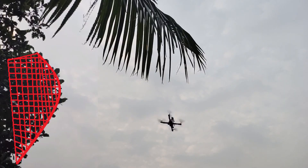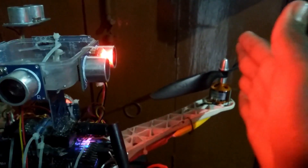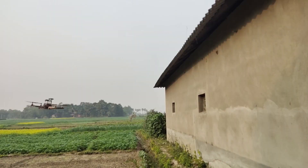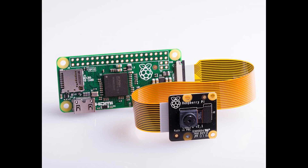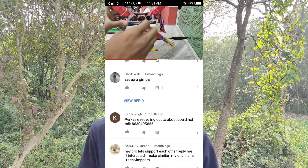There are still some limitations: it only works on flat surfaces, trees and solid objects are fine, but it cannot detect narrow things. Since we're using ultrasonic sensors, each sensor only covers approximately 10 to 15 degrees, so obstacles from diagonal positions can't be detected. For now it's working quite well, and in the future I'll make this system with cameras and OpenCV to get full 360-degree obstacle data. If you're familiar with Raspberry Pi you might know what OpenCV is. If you're interested in a full obstacle avoidance system, leave a comment and I'll make a dedicated video on that.